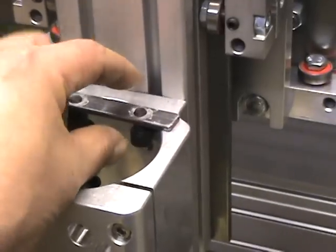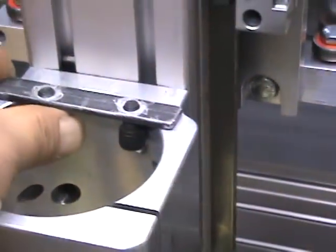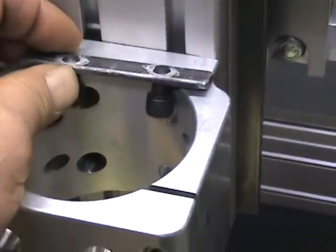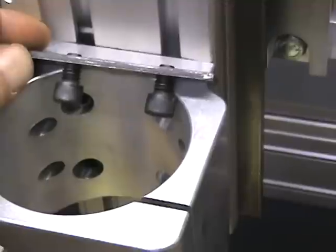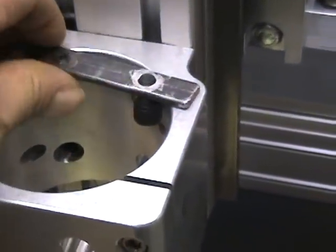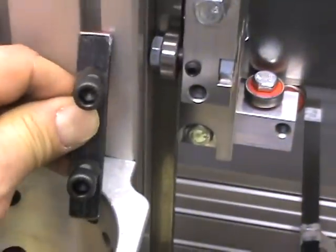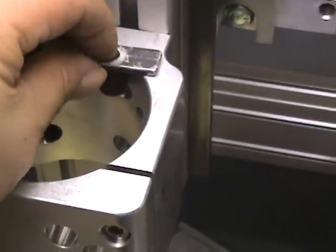The 80mm spindle mount I got didn't include any mounting brackets to attach it to the machine. So I got a piece of steel — one-eighth inch thick by half an inch wide — cut two three-inch pieces, centered and spaced them one and a half inches apart, drilled holes, and tapped five-sixteenths eighteen threads into them. It's a temporary solution as I'm planning a separate adapter system later, but there are about two and a quarter turns of thread, which should hold. The bolt heads go in here and the bracket slides up inside.